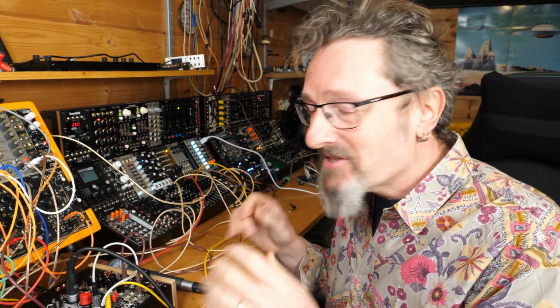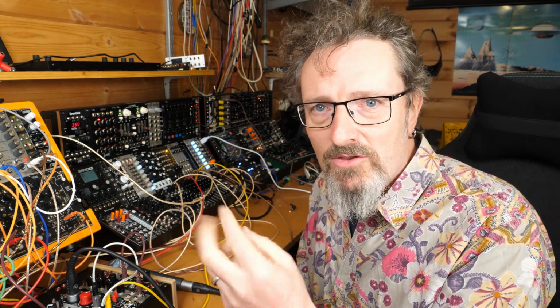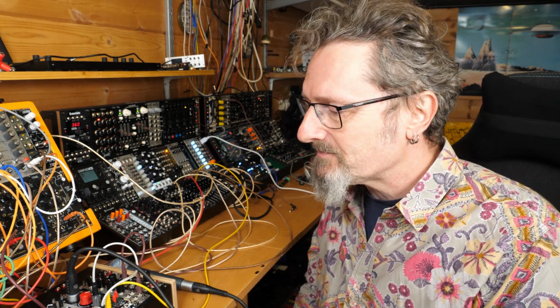So I took it apart and I resoldered and I checked this and I checked that. It turned out that one of the three-pronged ICs in there needed to be upside down because they'd changed it or something, and that increased the sensitivity, because the potential was that it wasn't really picking up the clock signal and needed to be more sensitive. It didn't work either. So I spent quite a bit of time resoldering, taking things out, putting them back in, retrying, retesting, and just really not getting anywhere.